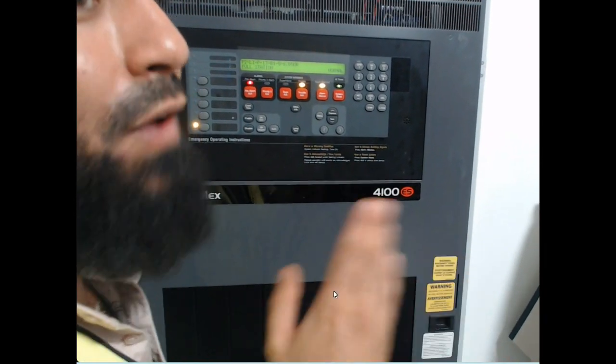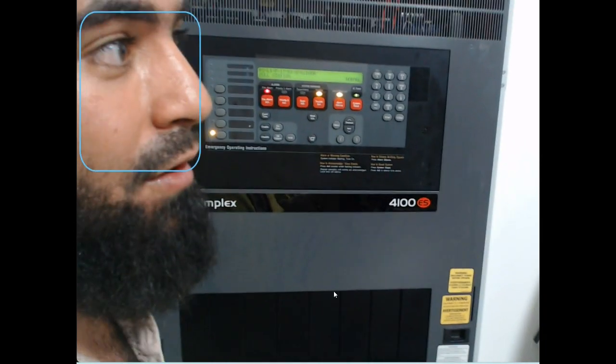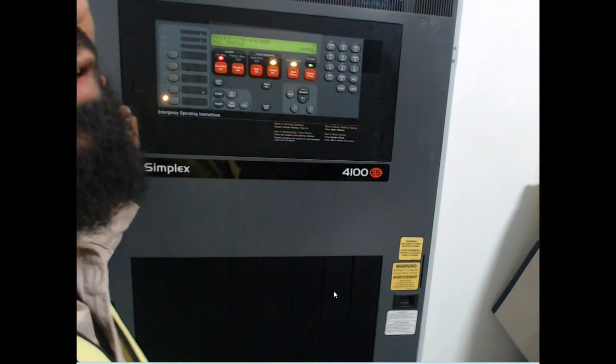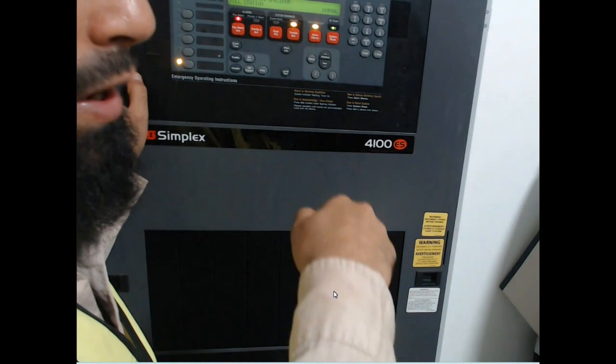This is the common and hard trouble in a fire alarm system — how to find it. The panel is showing open circuit, but all devices reply. I will connect only one cable and check the signal wave. After that I understand why there is no reply — because of a connection problem for the device.